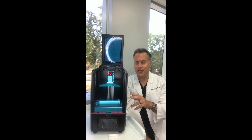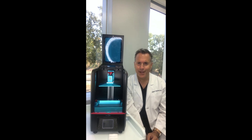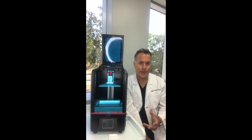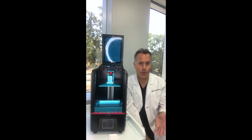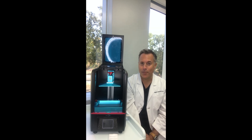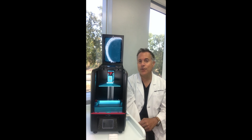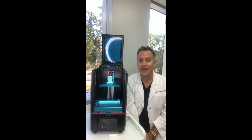The Form 2 uses a small laser beam to cure pixel by pixel in 140-micron pixels your entire model. A DLP printer uses a film projector to print out layer by layer. So the speed of DLP is about three times that of the Form 2 or an SLA type printer. The LCD has a lot of similarities to the DLP printer in that it does print one sheet at a time — whether you're putting one model or five models, they're all going to print at the same time. But the difference is these use LCD screens — basically an iPhone screen — to print your model instead of a DLP projector.